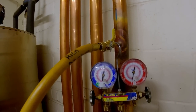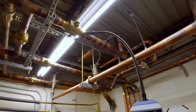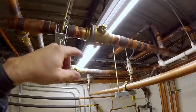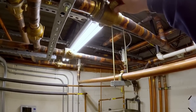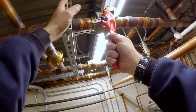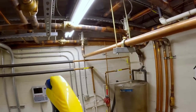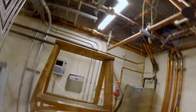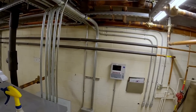We're going out to the heat reclaim unit. Right here to the heat reclaim — you can feel that plain as day. One thing I found that I do not like is this right here — there's a little bubble there. Not much I can do about that. Get on there with our other wrench — it's a nylon fitting so we don't need to get stupid with it. Let the air out a little bit — nothing there. Going to super-sensitive mode — we've got nothing. I've checked all my fittings on my pilot tubes and they're all good.